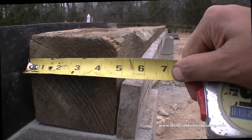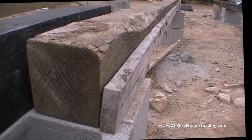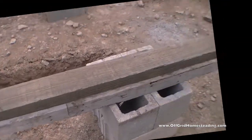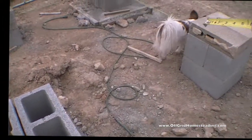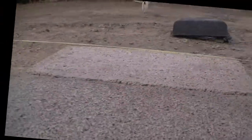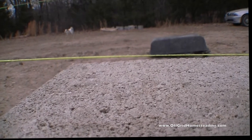This one here is four and just under three quarters, so I'm going to have to do a shim basically to go from here to here to here, and then we'll lag both these little guys in and we'll be good. This level here obviously needs to be at that level there, so I'll have to make a shim for underneath there and for underneath here. I'm going to grab the other eight foot beam and put it in right there. It had to come up just a tiny bit, and I may need to add a little more dirt underneath to get it level.